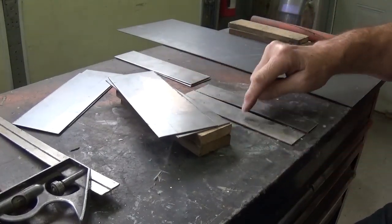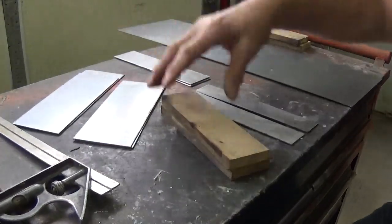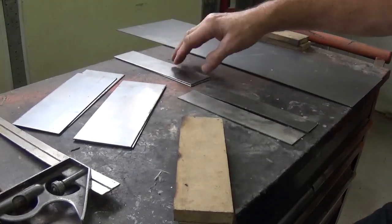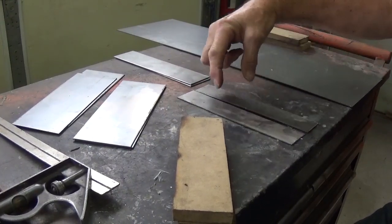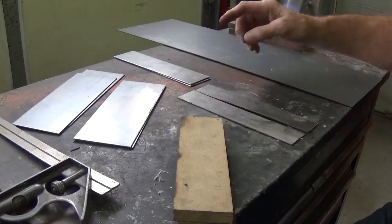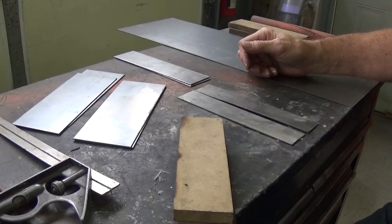I need 2 more of these yet. This is the sides, there's 4 sides. This is for a set of 2. 4 sides, then the cap for those. This cap will lay on top of the stainless steel. These will center themselves on the 1.5 inch square tube that's there. And then I'll make the piece that goes on the top of that then.